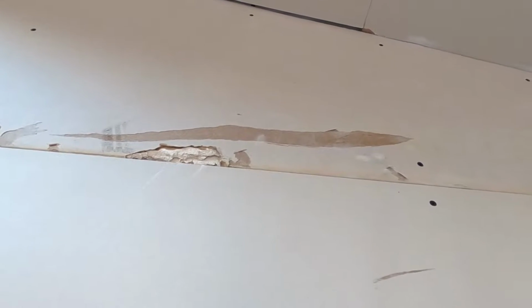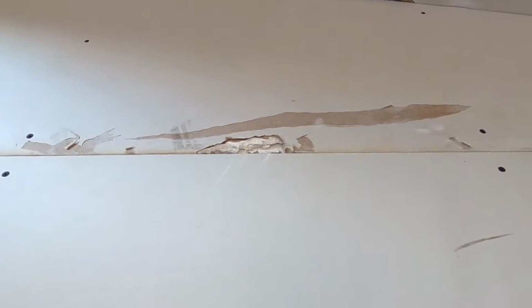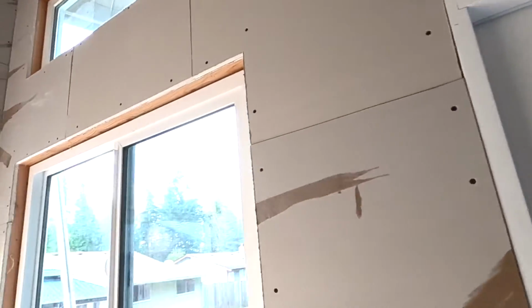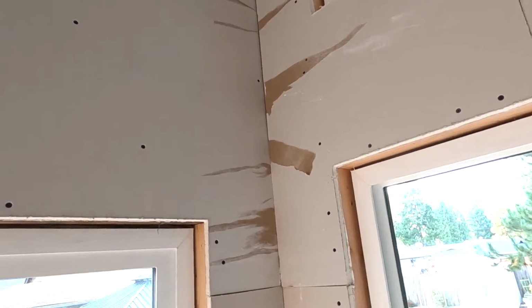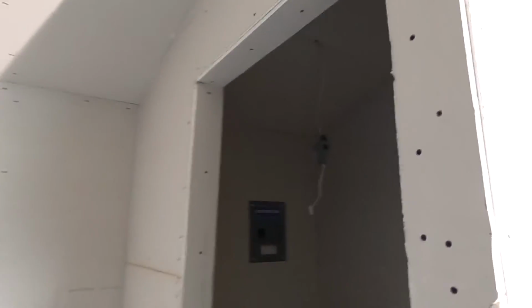A little gap up there, nice fracture there. Any loose paper that's peeling, hanging off the wall has got to come out, and any loose little bits of sheetrock that are still in there need to be cleaned out because it needs to be solid before you pre-fill it. Otherwise you'll end up with more bubbles and blisters. Okay, a little gap here. So yeah, every job has imperfections. Much more face paper torn here. They're rough, but no big deal. I've fixed these things a million times.